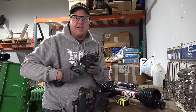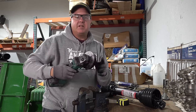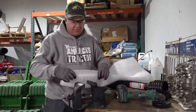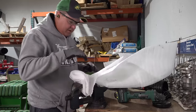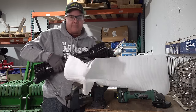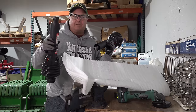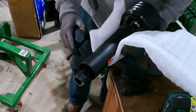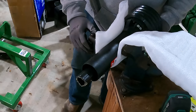I've replaced the grinding wheel with a cutoff wheel — a steel cutoff wheel, this one's from Norton, bought at Menards. They cost a dollar to two dollars, unless inflation has taken that. I have a brand new Wilton vise on the floor; not exactly sure where I'm going to mount it, pretty sure not to this old homemade bench. I'm getting this plastic shipping material out because what I've done is damaged the plastic coverings on these shafts nearly every time I do this — when I clamp it in the vise, I end up pinching the plastic. So I'm going to try this plastic as padding; I don't need it incredibly tight.